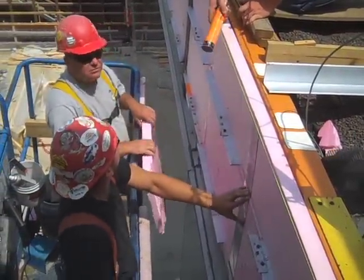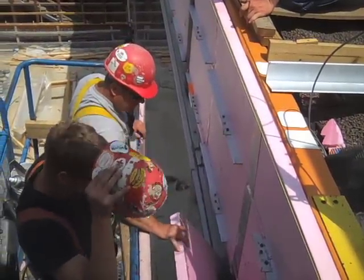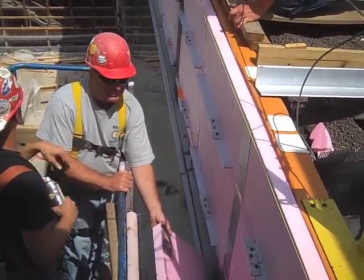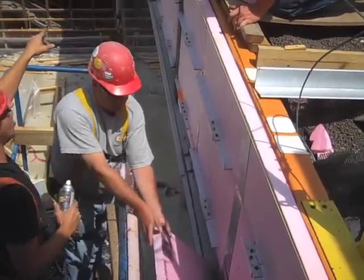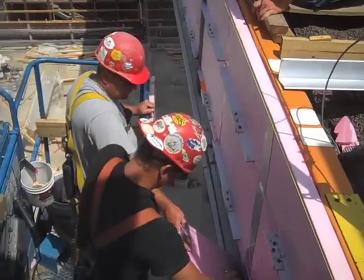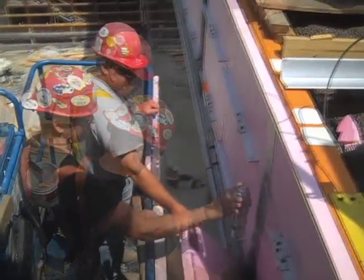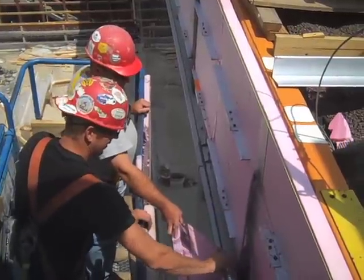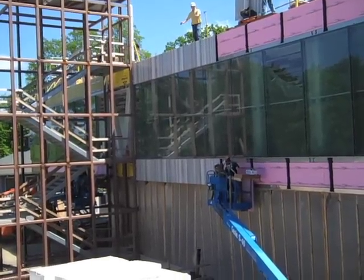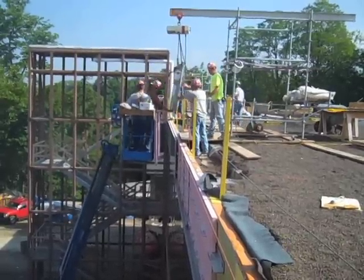The tape is said to be part of the waterproofing system, but in reality water is able to enter this cavity at any point through the open horizontal joints above the stone panels, and not just through the open vertical joints where the tape is applied. On the other hand, because extruded polystyrene insulation may be damaged if exposed to sunlight for extended periods of time, it's not a bad idea to protect the insulation from such exposure by covering it in this way. The tape is then spray painted black so that the uniform visual appearance of the facade is not interrupted by reflected sun bouncing off the metal surface of the tape at the open joints. Now the stone, stockpiled on the roof, can be lowered into place.